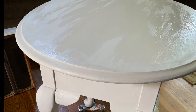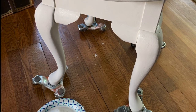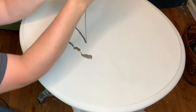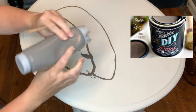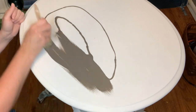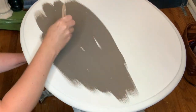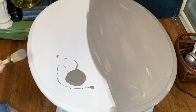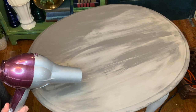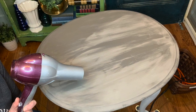Because DIY paint is heavily pigmented and clay-based, it covers really well — even though I'm using white, I'm only going to need two coats for full coverage. My first tip is to put down a base coat when you are blending. I'm using DIY paint in Prairie Gray and applying it all over the top. When you're using DIY paint it will lighten as it dries, so you can always tell when it's ready for the next step.